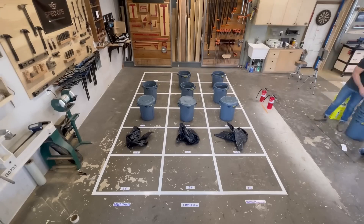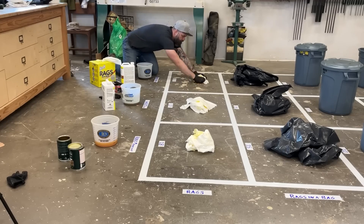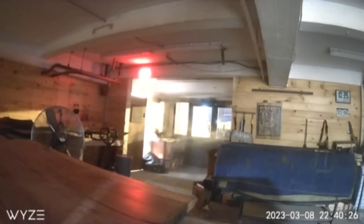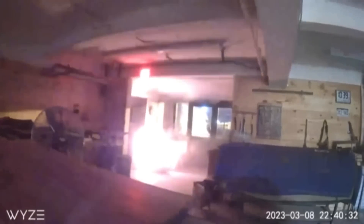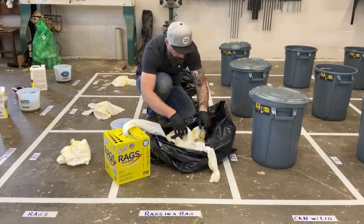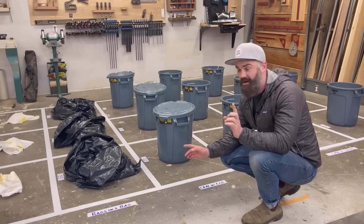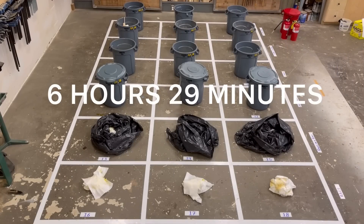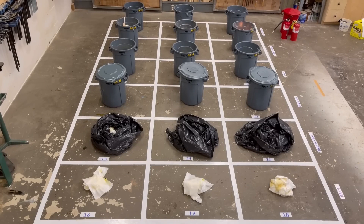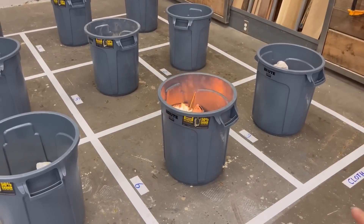Time for some tips and tools. This video is a few weeks old now, but it's such an important lesson in shop safety it deserves a shout out. Bourbon Moth Woodworking wanted to get to the bottom of the occasional phenomenon of spontaneous combustion happening in wood shops that can result when you don't properly dispose of oil soaked rags. He devised a scientific method of testing using three different finishes in five different disposal environments. The really insidious thing about this phenomenon is it can take hours to happen — easily in the middle of the night after your workday is done. TLDR: let those oily rags dry out on a flat surface before throwing them out.